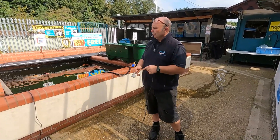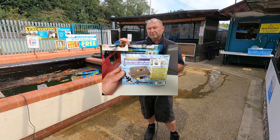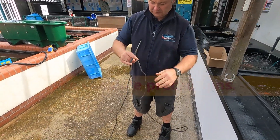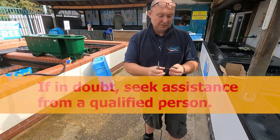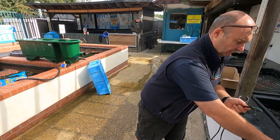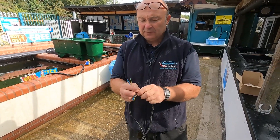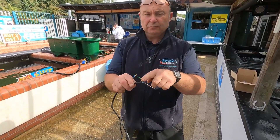This will work equally well whether you're going into a plug, wiring it directly into the power supply, or even using one of those heavy-duty push-pin connectors. The first thing we're going to do is cut the lead — I'd say about five foot from the plug — and make sure it's not plugged in when you do this. Then we're going to strip the wires. As you'd expect, you've got three wires: the live wire which is brown, the neutral which is blue, and the green and yellow one which is the earth wire.